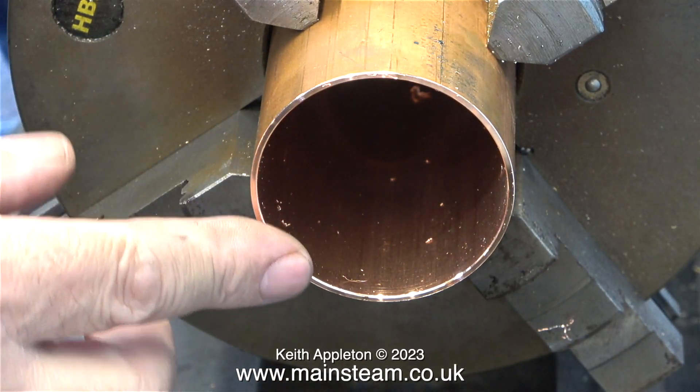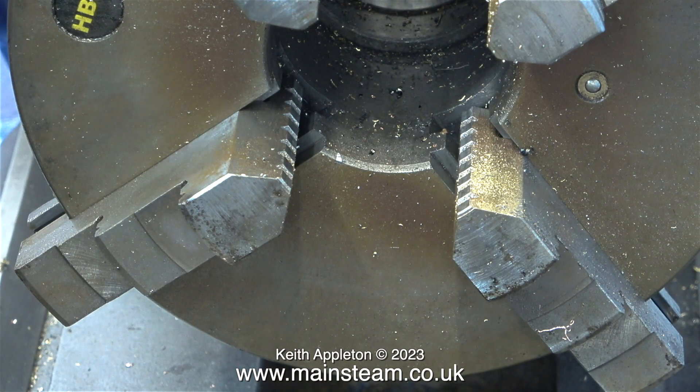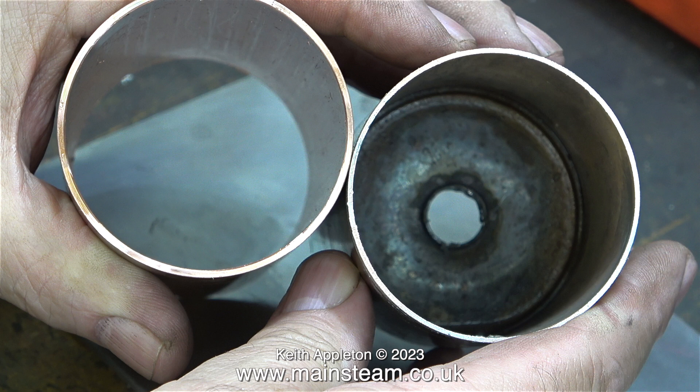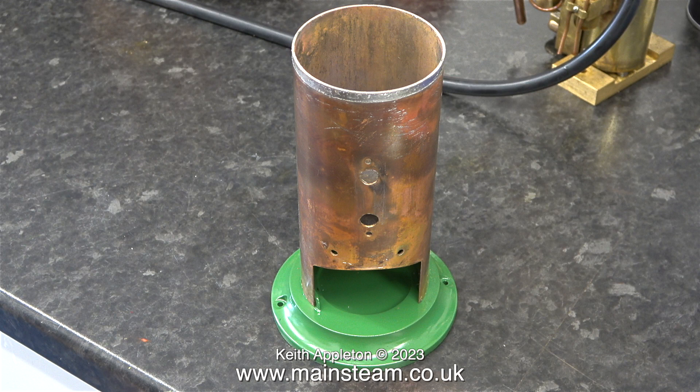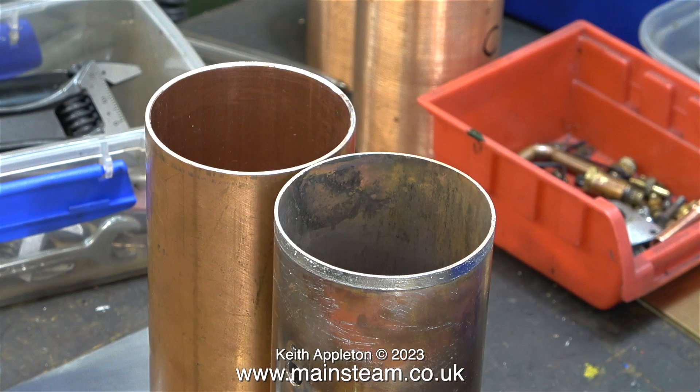Now the end of the tube is not sharp in any way and it's perfectly square — I mean the edges are at 90 degrees. The piece of copper tube on the left is 16 gauge and it's a good bit thicker than the piece that was originally the boiler shell. At some stage in the construction, preferably before it's been heated to red and annealed, I will need to use a boring tool in the lathe to reduce the internal diameter so it fits on the base. Both of these boiler barrels are exactly the same length.